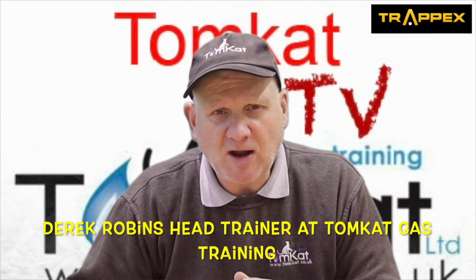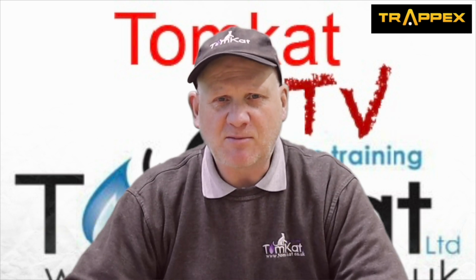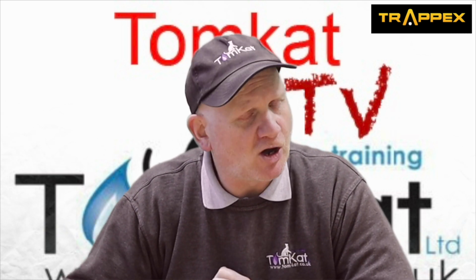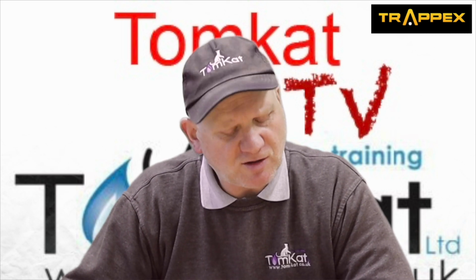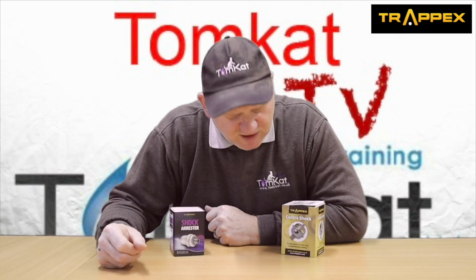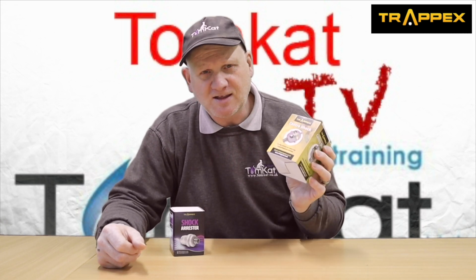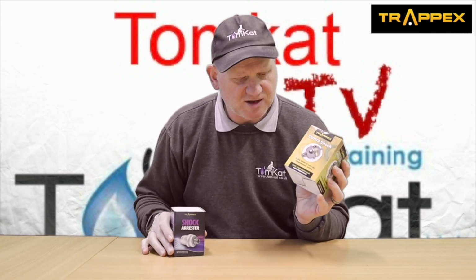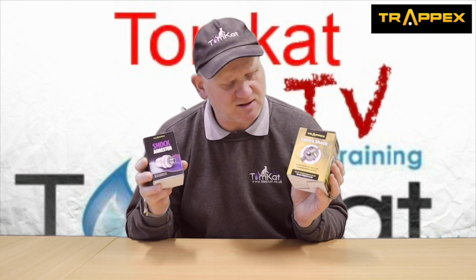Now, more and more boilers out there have plastic hydroblocks, and that means if you have a water meter or a non-return valve in your cold water supply, you're going to require one of these. So, what are they? Well, these are mini shock arrestors, and the two we've got here are produced by Trappex.